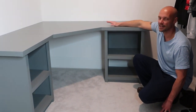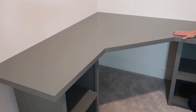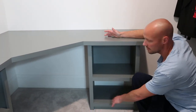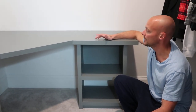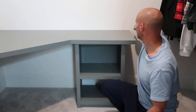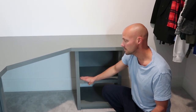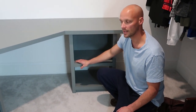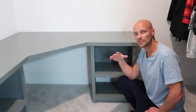This whole project — the top piece of wood is roughly $50, a little bit less because I had some left over from jobs. It's basically a big square with a 45-degree angle cut out of it and two rectangles for the arms. Between the desktop wood and the shelves it's probably a $50 piece of wood. Then for all the trim work I used 1x2s — I used about 14 of those. They come in 6-foot sections and they're roughly $4 a piece, and I used those to trim out everything including the front of the cabinet. I had paint left over from another project and I like the dark gray in here to kind of offset his gray bedroom.